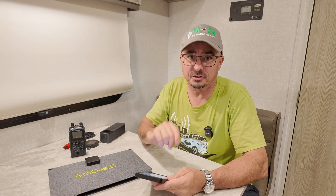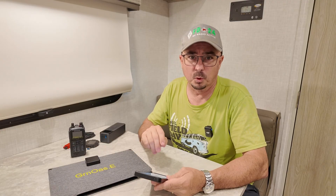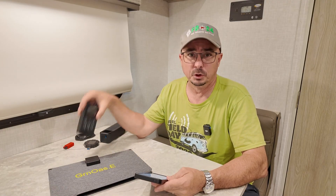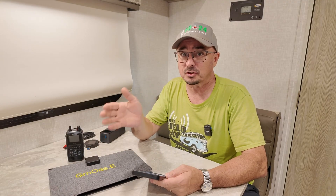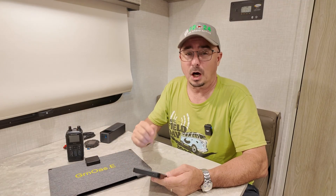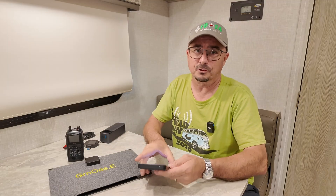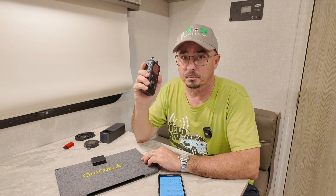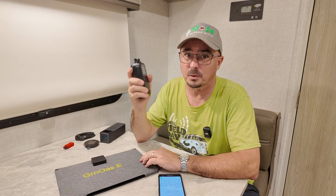After just one hour in the sun, the battery voltage read 7.68 volts. Keep in mind that somewhere around 8.2 or 8.3 volts is fully charged with this particular battery. After two hours, I was sitting at 7.99 volts — that's where it kind of topped out at the 70–80 percent mark and started to slow down. It took almost another hour to get completely charged. So it was just shy of three hours to take the D75 from completely dead to completely charged. In my opinion, that's a pretty good panel.